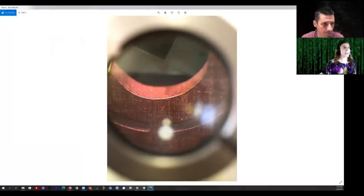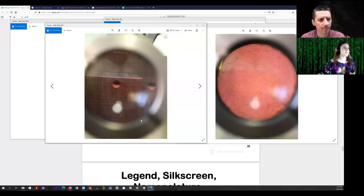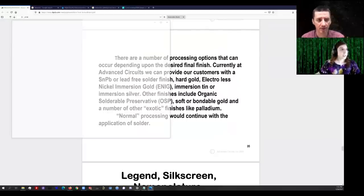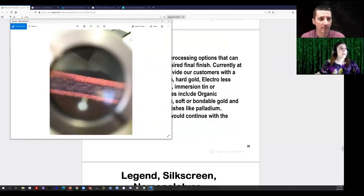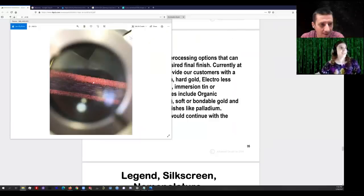At first the current density was too low, so I had PCBs that came out looking like sandpaper — very poor quality electroplating. This one is a little better, this one's even better. And here's one that's really nice electroplating — zooming in on the inside of a hole, you can see copper makes the 90-degree turn into the hole very nicely. That's good quality copper plating. If you get the parameters really wrong, you can get growths that are so large that even at low magnification in a microscope you can see them — and you can even feel them with your finger.